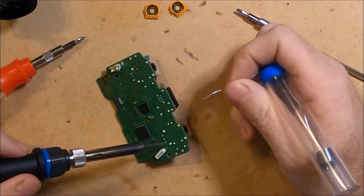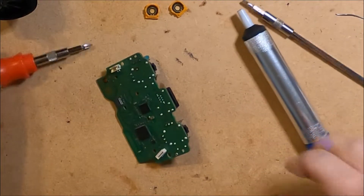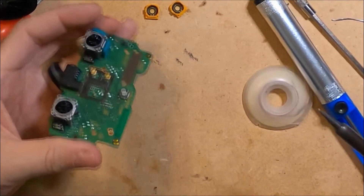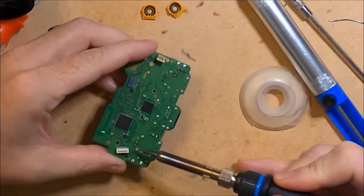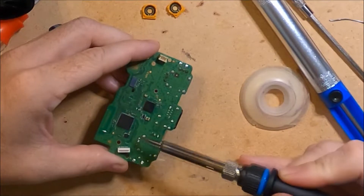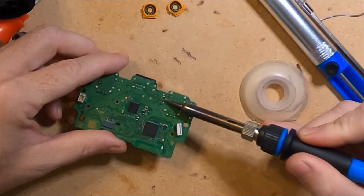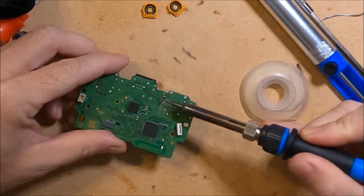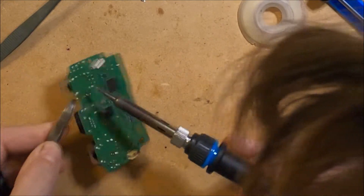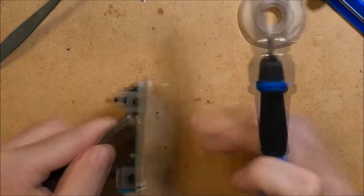I also added a little bit of flux. With the fresh solder added, I will now take the soldering iron, apply a little force to the pin, and push it down through the board. I do this for all six pins. I don't have to worry if my hands shake a little bit because there are no other components close by that I could accidentally damage. I then take a small pair of pliers or tweezers and hold onto the pin from the top side of the board while applying heat to the bottom, and the pin falls right out.